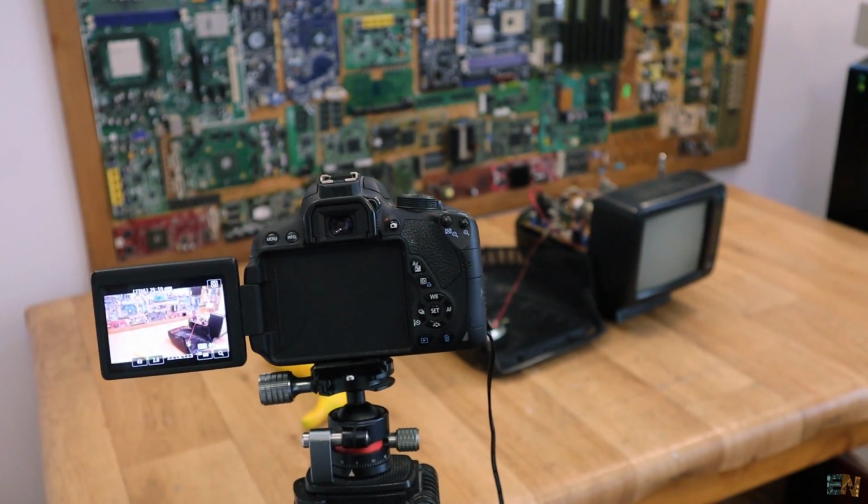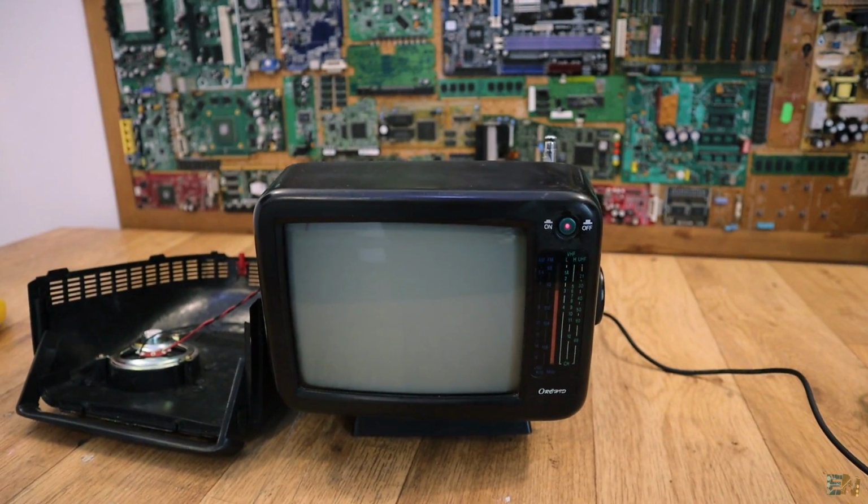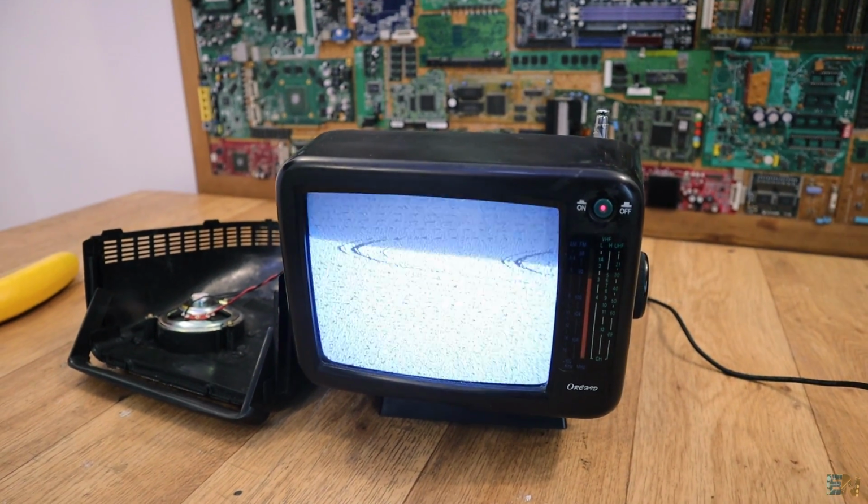But I will tell you that we'll see the cathode tube. We'll see a very cool component, which is the flyback transformer. What more will we see? Oh, we will see a band pass filter, because this is using analog signal. So you have to just pass one frequency in order to select the channel. And all the components that we have inside, of course.